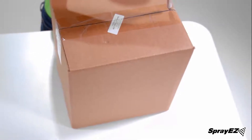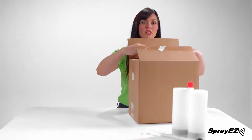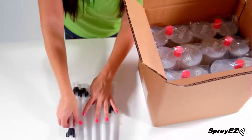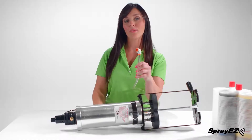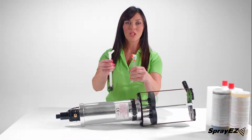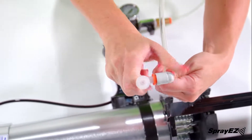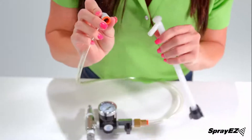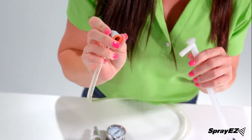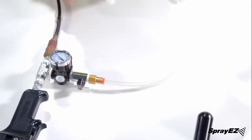One of the uses of the Fast Kick Gun is spraying closed cell foam. Open the case from the top of the box to prevent damage. Remove each of the static mixers, ensuring there are six in total, as well as six cartridges. This is the elbow bracket included in your package. Attach it to your static mixer until it clicks. To remove the elbow bracket, push it in and pull — there are metal teeth that grip the static mixer, and pulling without pushing in could damage it. The elbow bracket can be used on many cartridges if used properly.